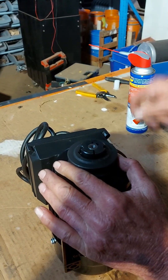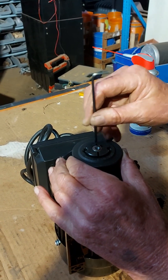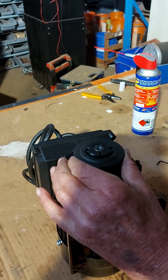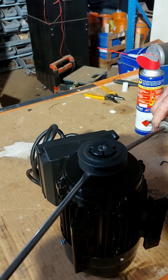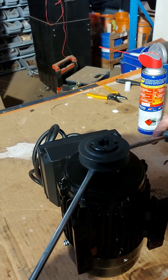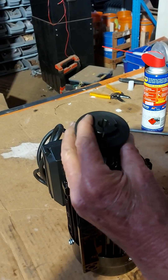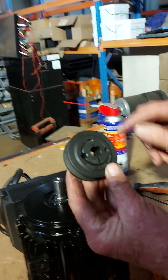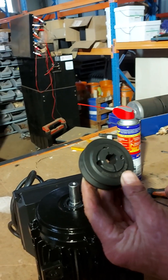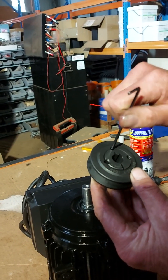Just leave that grub screw in a little bit — you can go in a fraction more, about there. Just get a couple of flat screwdrivers and gently pry that off. Sometimes they'll just slip off with your hand. You can see the two grub screws that were retaining it have nothing in there, and this is the one we just used to pull the taper lock apart.